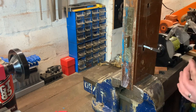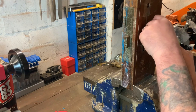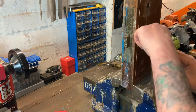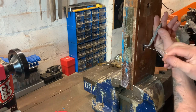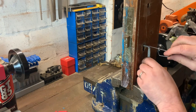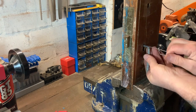Picking it in the door is a little bit different — getting your wire in is trickier because you've got to make sure you're in the lock and not stuck in the wood between the lock, which I have done a couple of times. There you go, that's it — you can see the bolt moving, so we've got tension on it. Let's see if we can get it open.